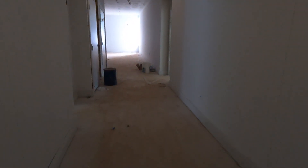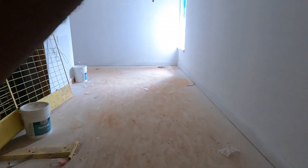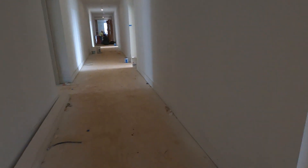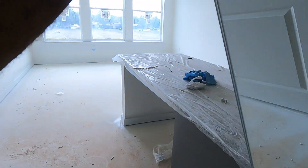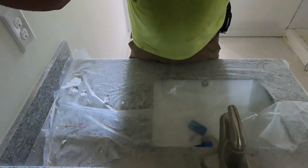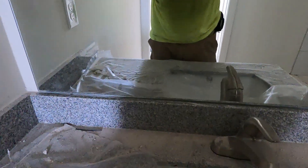It's pretty simple — one of the easiest things you could ever do. If your mirror is all messed up at home, get yourself a worthy suction cup and pull that mirror off. Hopefully whoever installed it followed the same standard of putting mastic on the wall. We're back to our hole, shims are down. The reason I put those shims down is to get a soft landing and make sure the mirror doesn't crack on the backsplash when it settles.